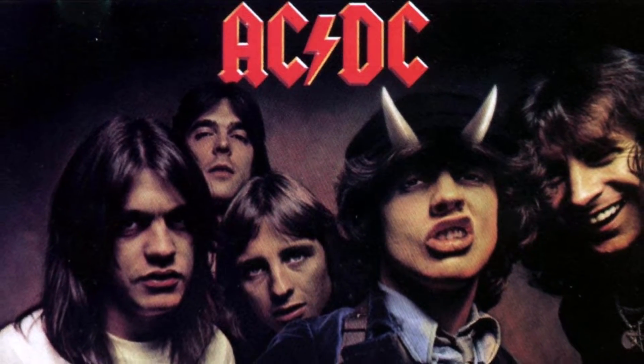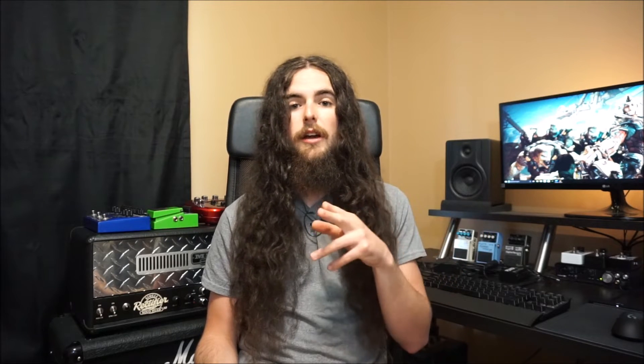The first spec is AC versus DC power — alternating versus direct current. Not talking about the legendary Australian rock band; we're talking about electricity. Everything that comes out of your wall socket is alternating current, meaning the electrons and the electricity flow are actually flipping directions back and forth at a set rate. Here in the States that's 60 times per second, or 60 Hertz. Elsewhere in the world you'll see as low as 50 Hertz, depending on the region.